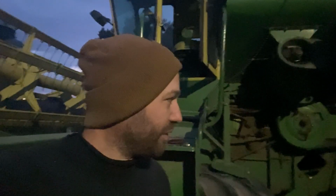I'm at the end of my first day of prep work on the combine here. I didn't take a lot of video, nothing too eventful. Mainly got the oil changed and greased everything really good. And I've just been going through and checking chains and belts and all the little odds and ends that you need to address. But really, there's not too much to do. All the work we did last year has still held over, given that it only had about 30 hours of runtime on it. So the chains and belts look tight and in good shape yet. And everything's good. So we just need to top off some hydraulic fluid and do a couple of other little odds and ends.